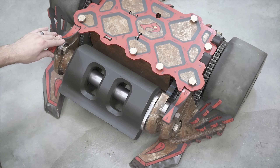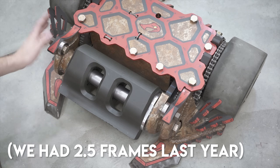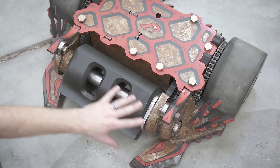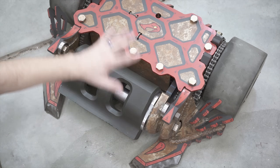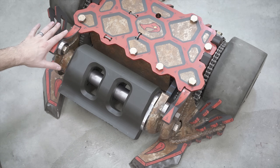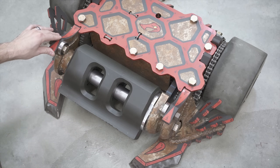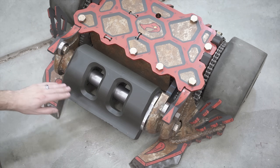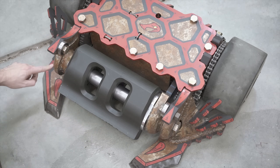In terms of the actual frame, we are using the same two frames that we had last year. One of the frames got damaged in the Kronos fight and was not possible to be repaired, but we had two backup frames that we are using. Those remain the same, but we did go through and add several pounds worth of welds to everything, so they're a lot more beefed up than they were last year. Any issues we had with flexing or bending, we have more welds in there. In addition, a lot of the right angles have been filleted or ground down so they're a little smoother, so if a blade comes across it's going to hit a curved surface rather than a sharp surface — possibly less chance of catching.